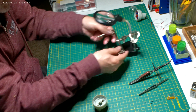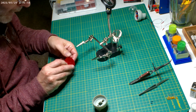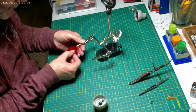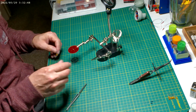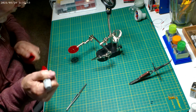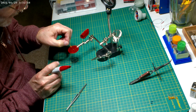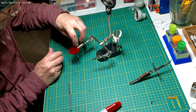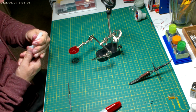all right. We don't need that. We've got to get those bulbs glued in first. Get the red marker and mark the positives, because once you start bending them, it's easy to get confused on what you have. You want to try to keep your positives in the center. Yeah, we want the positives to face inwards. And you just hit it with some super glue.